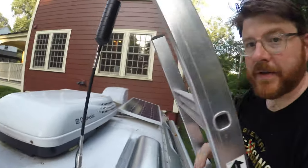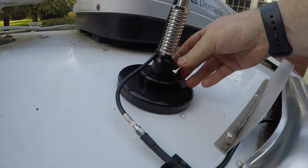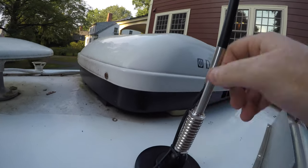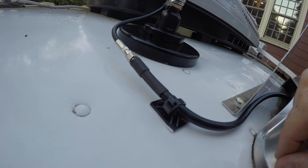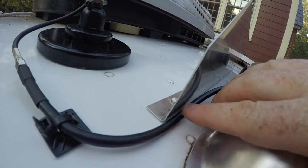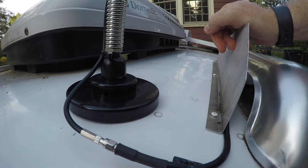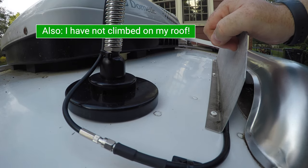It's a little hot out here, but you can see the whole installation is good. We've got the CB antenna mount that I adapted here, and it's holding the antenna. There's Loctite here and here, and the antenna goes all the way up. The wire comes out of the back of the antenna here and just loops around where this connection is made. I'm using a cable tie to keep this on the roof, do a little strain relief, and keep it away from this fin. It goes in here to this cable gland. The fin has been reinstalled with new VHB tape underneath, and I put these screws in. Take a moment to recognize: we put no holes in the roof — none at all. No screw holes to mount it, and no drill hole to drive the cable into the interior of the trailer, which is really nice.